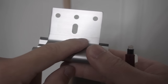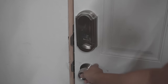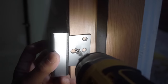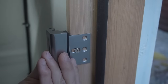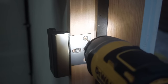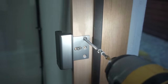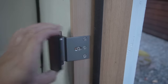Looking right here at the back — that's how deep I'm going to install this, because some doors like this one stick out a little past the door jamb, so I can't make it fully flush. Just open up your door — it's going to be a temporary screw. We're going to go reverse to prevent this from splitting, and there you go. From there, you can adjust this to the depth that you want. The drill bit size I'll be using is a 3/32nd — I'll leave the link in the description down below. Finally, we're going to install the 3-inch screws. That's pretty much it — simple as that.